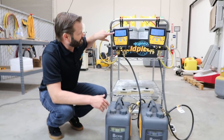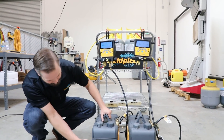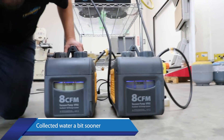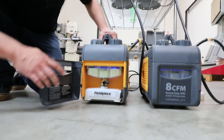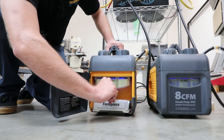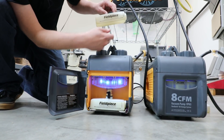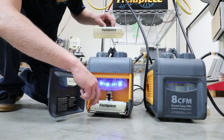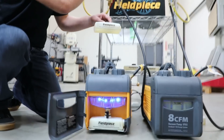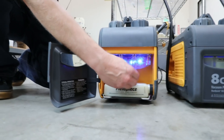Both pumps got to about the same level — floating just under 1600 microns. You'll see the oil looks about as dirty on both of them. We're going to go ahead and change oil on this one, right on the fly. I'm going to open up this valve and you'll see it drain out. Just a couple seconds to make sure all the dirty oil gets out. Notice nothing happened to the microns up here — we're running with no oil, we drained it, and we're still under 1600 microns. No change in our microns.